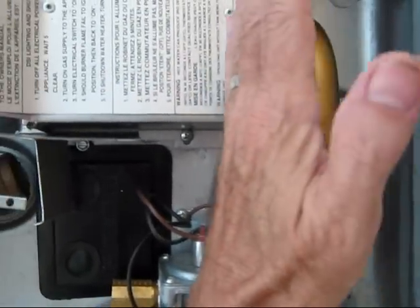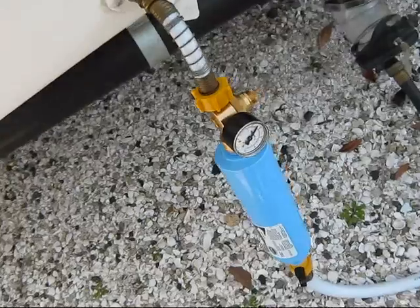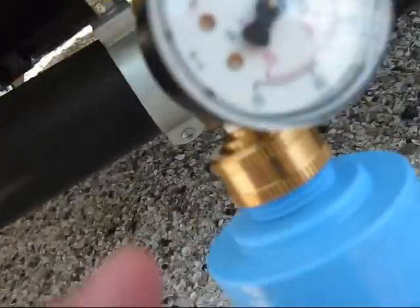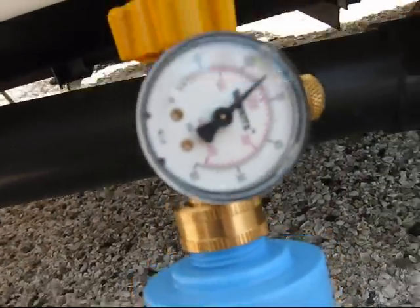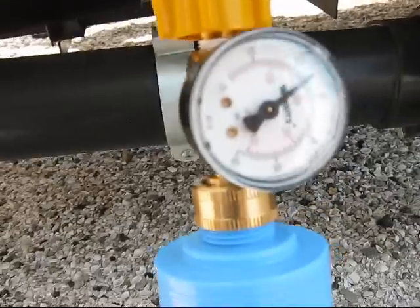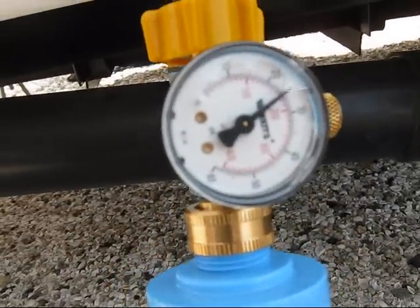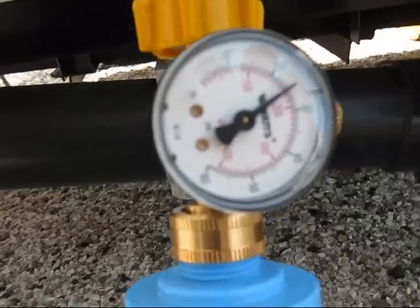What's happening is there's a six-gallon tank in there, and the water is just filling up in it. Now if we look at our Watts here, we're sitting at 25 pounds. So that's 25 pounds from here running into the trailer. The adjustable Watts has done its job taking it down another 15 PSI.